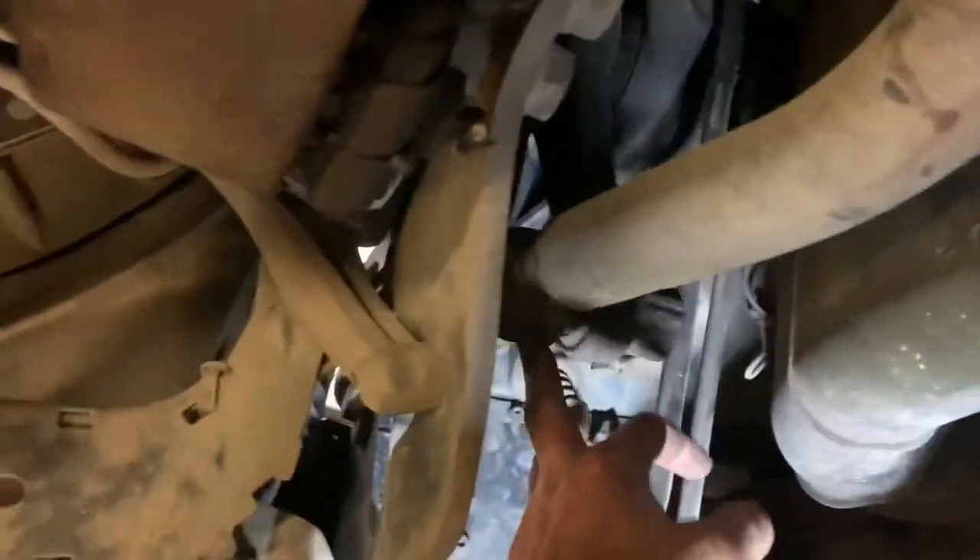Power steering on this Scania 450. It's wedged up there. Need the air filter box off here, that drag link off, that needs to come off, jack up the cab, tip the top UJ off - steering UJ. Let's get on with the job.